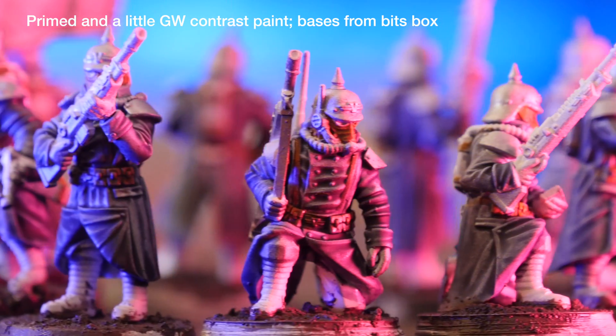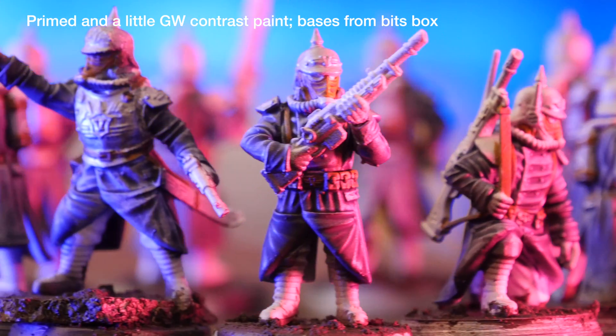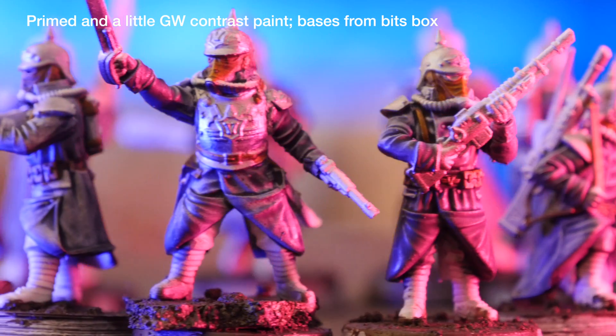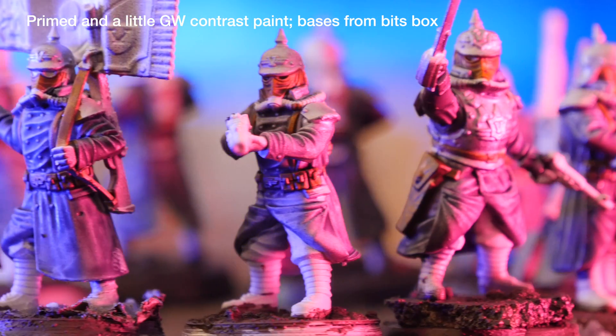Another reason to consider the Sonic Mini 4K is the new monochrome LCD display, which is a lot faster than a traditional colour one, meaning that each layer will take as little as two seconds to cure. This is in conjunction with the Para LED version 2, which is a parallel UV LED matrix ensuring smooth and even light distribution underneath the print. So this full tray of little guys took under three hours to print. Obviously they're small, and it's the height that will increase print time — twice the height, twice the time. But still, two seconds per layer is pretty amazing.